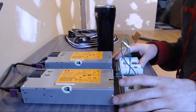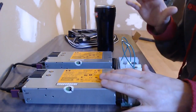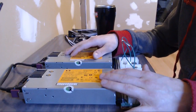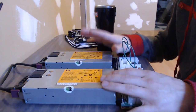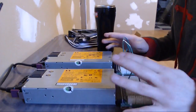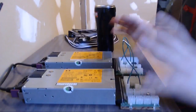I have an 18 gauge cable and a 16 gauge cable, both of which are just fine for these power supplies. Since they're only 750 watts each: amperage equals watts divided by volts, so 750 divided by 110 is just shy of 7 amps. With an 18 gauge cable you can get about 8 amps, so I should be fine. The 16 gauge is obviously overkill. Together these two supplies only draw about 14 amps, and a standard 110 volt circuit in North America handles 15 amps, so I can run both on a single circuit.